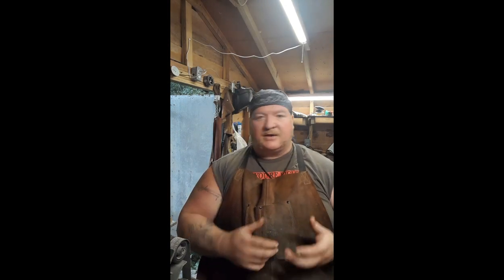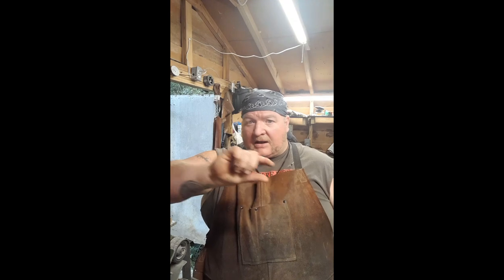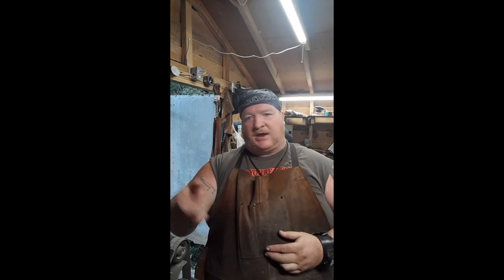This week we're working on a Celtic Ring Knife. Now, these are similar in theory to the blacksmith's knives, in that there's no woodworking. It's a very simple design, just one piece of metal and you hammer the whole thing out. It's not decorative in the slightest. You could decorate it, but it's a very utilitarian piece. It's just a straight blade and then a handle with a little ring on the end that served like a pommel. You take it, wrap that around, and voila, you can wrap a little leather on there or something, and off you go.